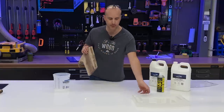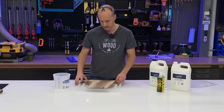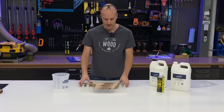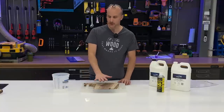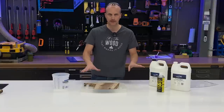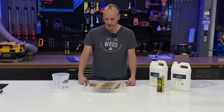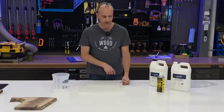The piece of wood is fully shaped and prepped. Watch the magic — like a glove. You'll notice the wood is sitting a little higher than the mold — it doesn't matter. We're going to pour epoxy in here, demold it, and run it through the planer to level it. So if the wood sits a bit proud because it's warped, we'll get rid of that at the finish stage. Before we do our pour, we actually want to use some mold release.